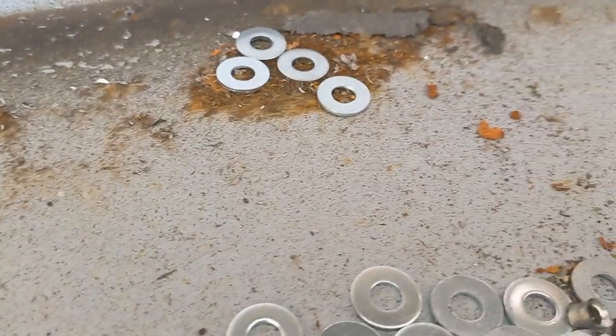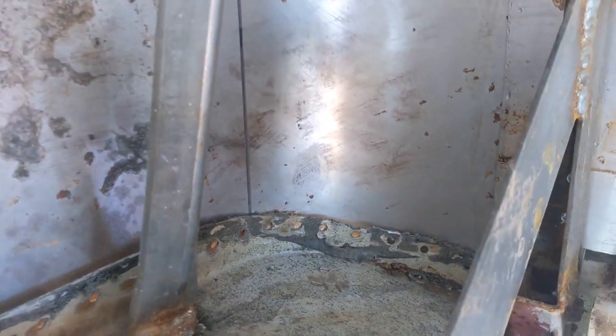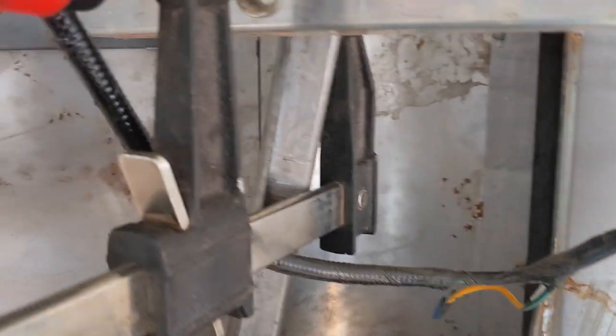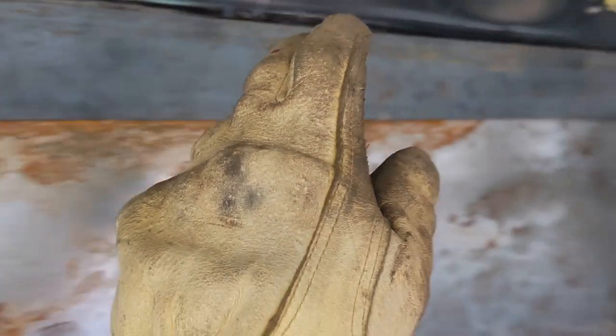I am all prepared for that. So they'll be riveted in around the corner. That will suck that up very nicely. Down here, that already looks really nice. So the metal's flexible enough that as long as you're close, you can pull it up tightly. But you've got to start in the middle and work your way across.